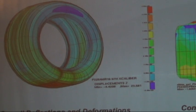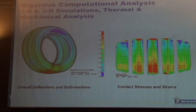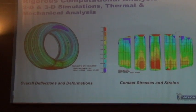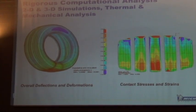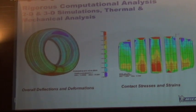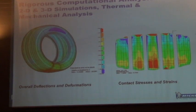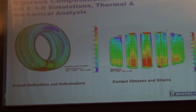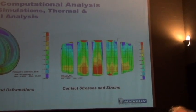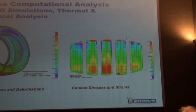All this information transfers automatically into a manufacturing system that builds prototypes or production tires with robots. Once I create a 3D graphics model of the tire, we start our mathematical analysis. We have models that look at things like overall deflection — we can look specifically at what the stresses and strains look like in the contact patch, which is critical for grip, wear, hydroplaning, wet grip, and rubber endurance.